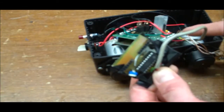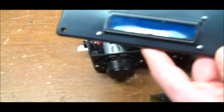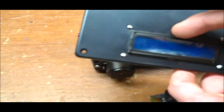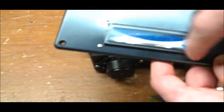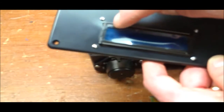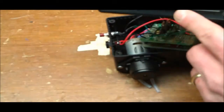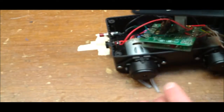The MCP23008 communicates via the I2C bus on A4 and A5 and drives the LCD screen. It's a 2x16 display: the top line is for pump one, the bottom for pump two. It shows how many times each pump has run, the date it last turned on, and the time it last turned on.